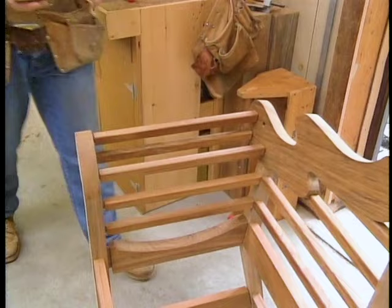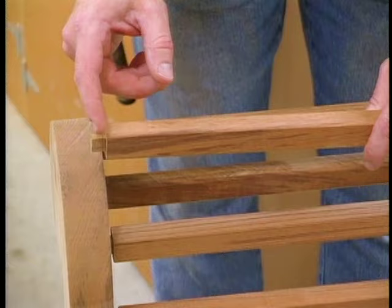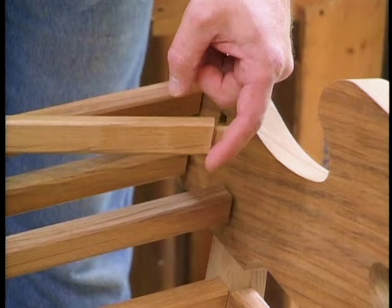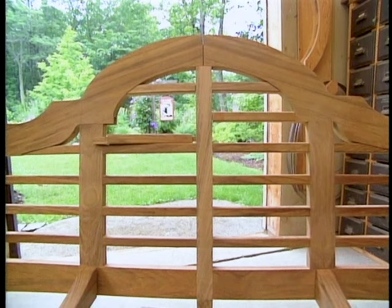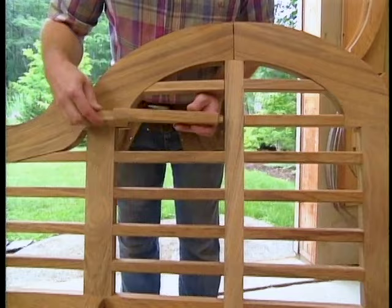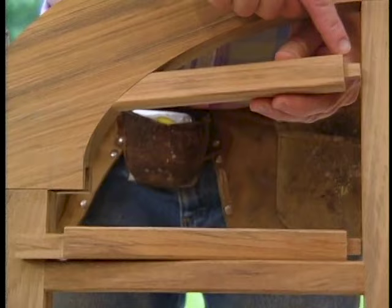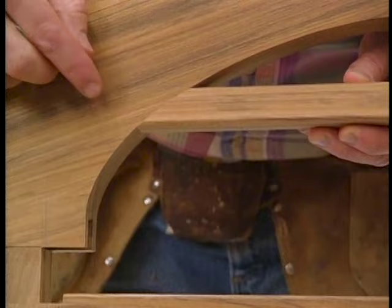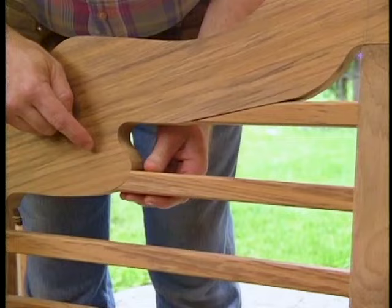Let's look at the slats. All the slats have the same cross section — they're one inch square with rounded corners. The armrest slats have tenons that are ninety degrees at the front end, and at the back they're cut at ten degrees which is the slope of the backrest. All the slats on the backrest have ninety-degree tenons with the following exceptions: one has a standard tenon on one end but an extended tenon to fit into the mortise of the decorative backrest; another has a standard tenon on one end but at the other end there is no tenon — it's just fitted to the curve and secured with a screw. One has a long enough slope that it can be secured with a biscuit, and lastly one is cut to the curve and secured with a screw.